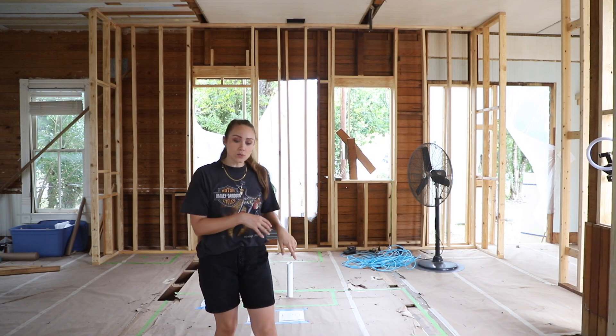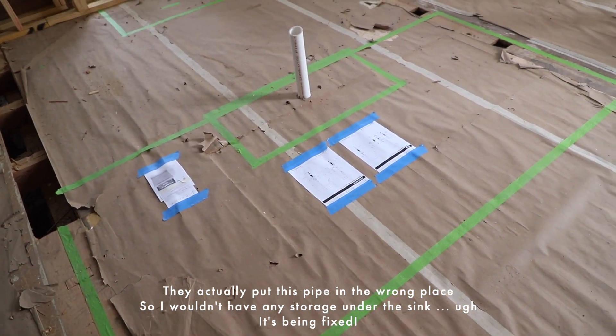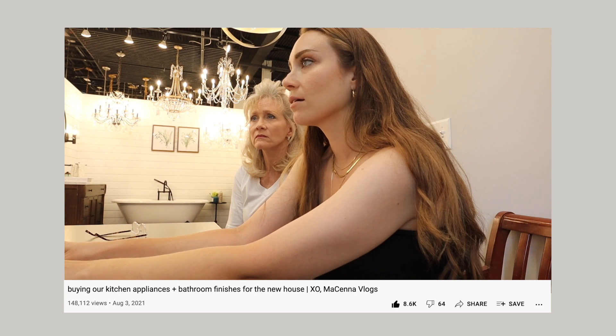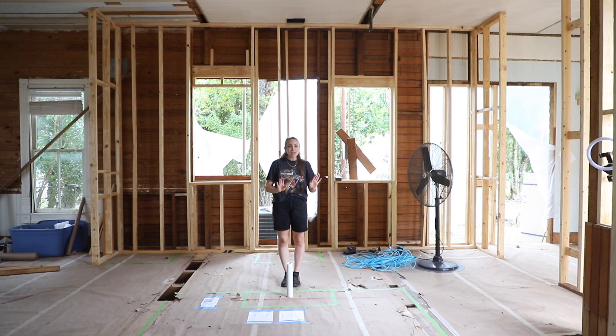The plumbers have been here for the last couple of days, focusing first on roughing in where all the plumbing items — the tub, the shower, the washer and dryer, the sinks — are going to go in the addition, so they can pour the slab and foundation. They're also making their way inside the main house for the guest bathroom, the kitchen, and fireplace-type items where we need water and gas. This is the kitchen — I've marked off where the island is going to go and within that where the sink is going to go. I also taped down the exact faucets we ordered. Already roughed in the drain for the sink, and they're coming back today to do the holes in the floor for the water lines coming into the sink.